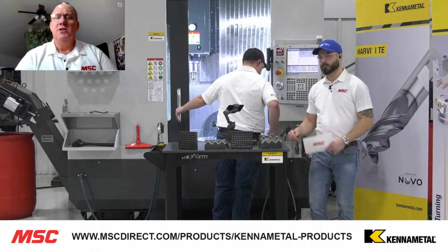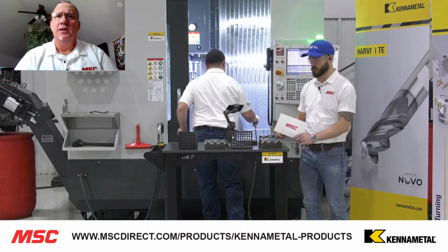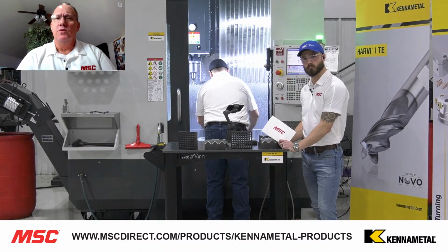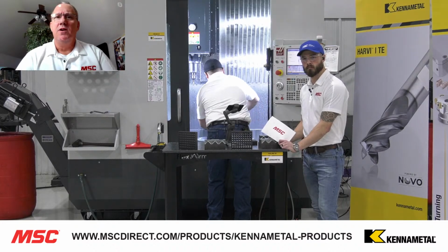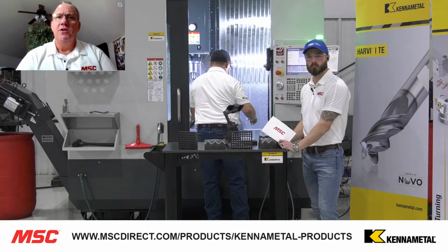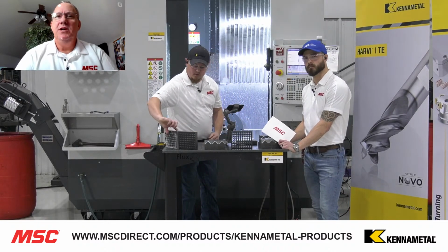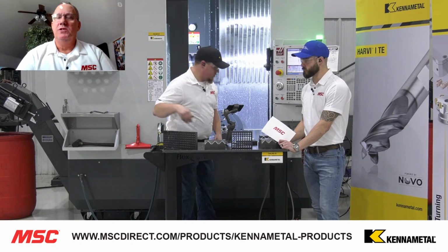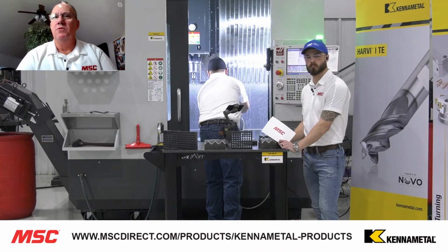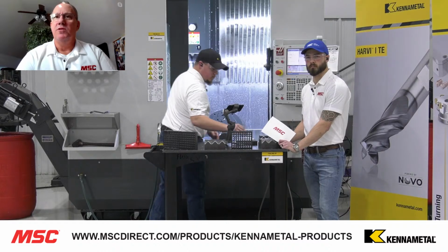To me, that's a very precise holder when you're running solid carbide drills, especially as we move to the next drill and start discussing briefly the HPX drill. So I prefer the Hydroforce holder, but you can run it in our HP line, a hydraulic holder, or a milling chuck, heavy-duty milling chucks. Eddie, you can run them in ER collets for that matter. But especially when you get into high-performance tools, it's all about using high-performance holders and getting the best tool life and the best precision hole diameter that you can get.